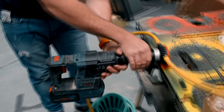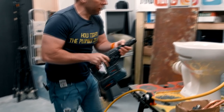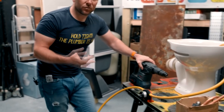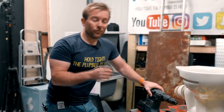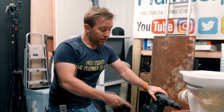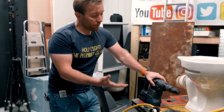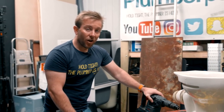So another reason I'd use one of these - as you've just seen, it's going to empty any receptacle that you want to empty, and it's also going to be strong enough for you to pump down a hose that's 20 to 25 metres plus. The other thing these are really, really good for - and I wish I had it yesterday - I was working at a house where they had radiator pipes in a screed floor, and I was changing the radiators over. Because those pipes in the screed floor weren't draining, these are great for that, because you can stuff that hose over the cut pipe, pop this on there, and suck all the water out of the undrained pipework that you can't get to. That means you can then nice and safely solder it, because as you guys know, you cannot solder pipe with any water in it. Very, very simple tool, very easy to use, as you've seen demonstrated so easily there.